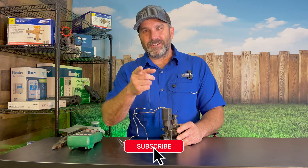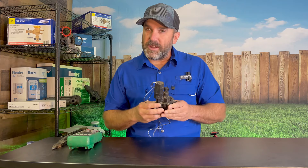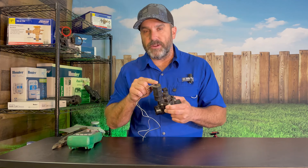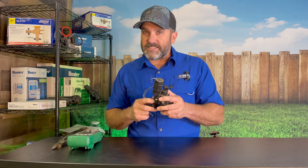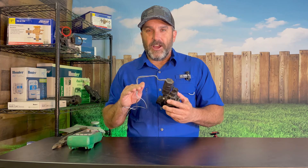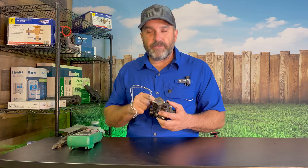My name is Kelly Staggs and you're watching American Irrigator. If you've got a Rainbird DVF style valve — Rainbird is the manufacturer, the model is a DVF — all the Rainbird DVF valves have this same solenoid. So if you've got this style of valve and you're trying to test the solenoid, the numbers you're going to see today are the exact numbers it should be if it was good. If you get anything else other than the numbers I'm going to show you, it could indicate that your solenoid is bad.